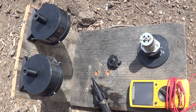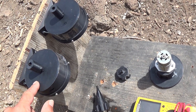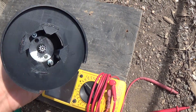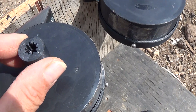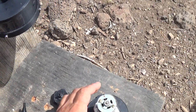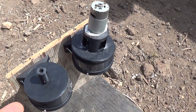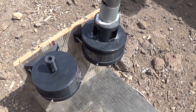We're outside getting ready to do the primary test of both Tesla turbines. I've got them mounted to a test board — number one is the copper-filled PLA heavier turbine and number two is the carbon fiber nylon lighter turbine. We've got a little mount for an electric motor that we're using as our generator today, with a spline connector on the output shaft. The spline connectors on each turbine will let us line up the generator, lock it in place, test one turbine, then quickly swap to the other — using the exact same generator for both.